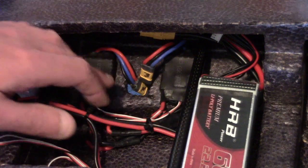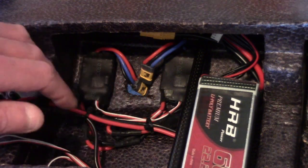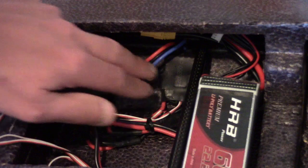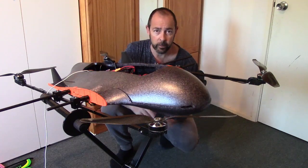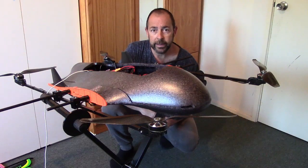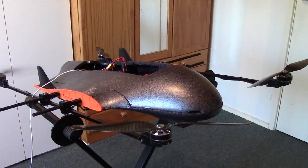In a previous incarnation of this plane, I cut a couple of holes through the foam so I could run power wires out to the ESCs and motors. I've now mounted the 40 amp ESCs internally, just using some double-sided tape to hold them in position. Now that the flight controller is mounted, I'm almost ready to test this in copter mode. Initially I'm not going to worry about testing plane forward flight mode. Before that, I need to test the motor sequencing, that everything is plugged into the correct servo outputs on the flight controller, and also the direction of rotation of the motors.